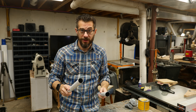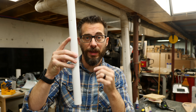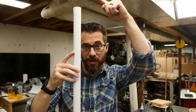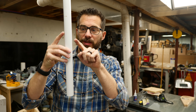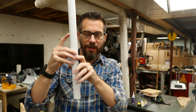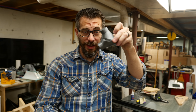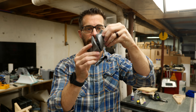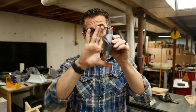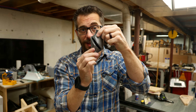We've come up with a way around that using Fusion 360 and 3D printing. Imagine this is the entire arm and there's a joint right here in the middle. We want to have a bike cable that runs up through that joint all the way to the very top so that we can loosen and tighten that cable, locking all the joints into place. If you think about this piece being sliced at an angle, that angle can then be the pivot point for the elbow joint. In Fusion 360 we made something that will effectively do the same thing — these two pieces will go into the pipes and mate together so the cable can go through this hole.